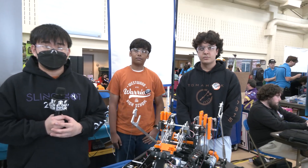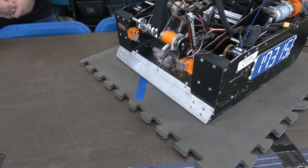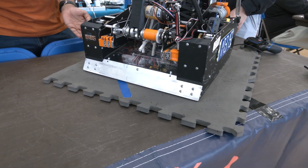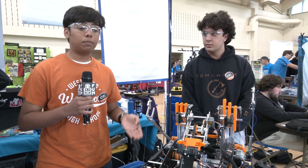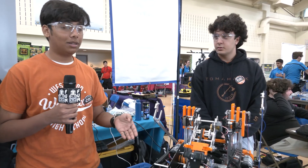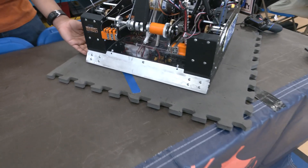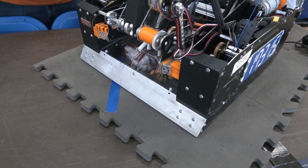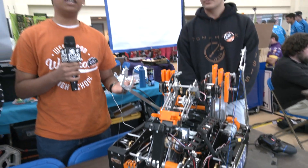Before we go, I want to ask Soren more about the wedge on the robot. The advantage of having a wedge is that with our old wooden design, a common problem during competitions was that we weren't able to access the submersible because the specimen bot would be blocking us. So we created a wedge which lifts their front panel a little bit off the ground, meaning they only have two wheels contacting the ground versus our four. This gives us more pushing power, so as we push the robot to the side we're able to access the sub easier and score points even if we're being blocked by a spec bot.